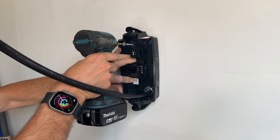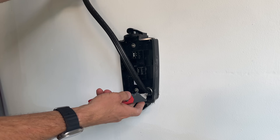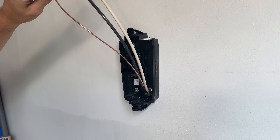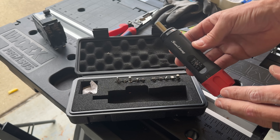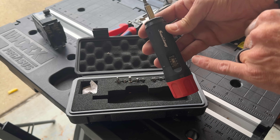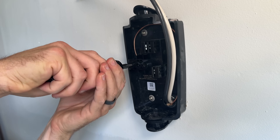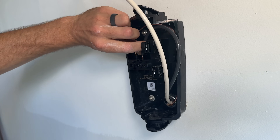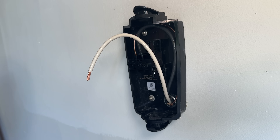On the other end we'll connect that connector, make sure everything's level, sync our second mounting screw, and secure things up. With everything securely mounted and wire to length, we can start landing the wires in the screw terminals. We'll start with the bare ground, then use a torque screwdriver — a cheap one off Amazon — to tighten the terminals. Tesla includes the bit, and you adjust it to 50 inch-pounds as called out in the Tesla specs printed on the mounting plate. For stranded wire, work the cable back and forth and do several rounds at the set torque.